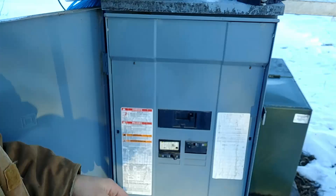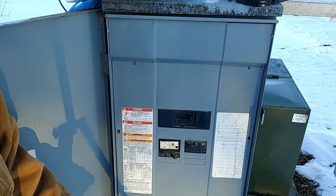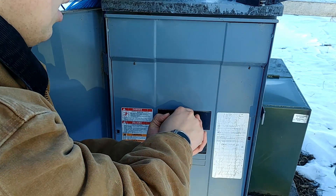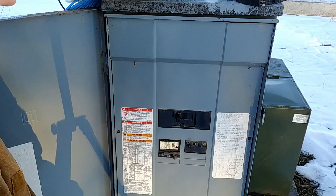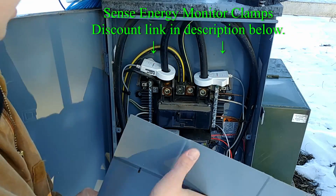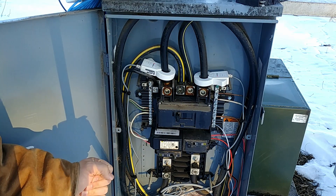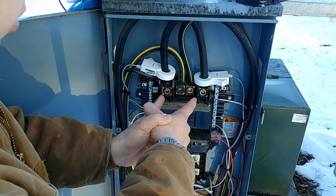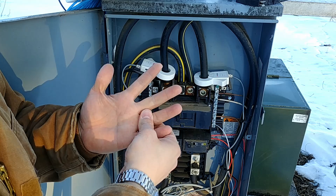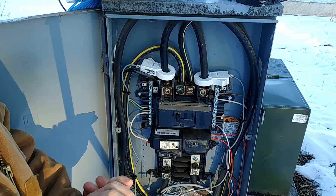We're going to focus primarily on the installation of the new breaker, and then at the end of the video we will install the receptacle itself. So the first thing we're going to do is just turn off the power right here. If you had a main panel in your basement, this would look quite similar — I believe this is called a feed-through panel because it has feed-through lugs on it. Now you have to remember that these top lugs are always going to be live, so no jewelry — I'll take off my ring and my watch.